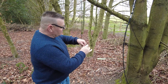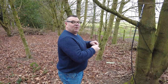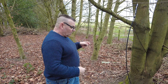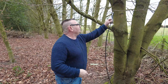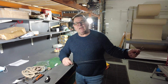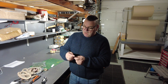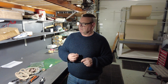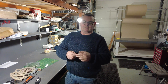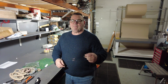After all this, Tom and I are of the opinion that to go backpacking with a full-size dipole — even though it is linear loaded — is slightly crazy; it might be a bit of a big ask. We've overshot: every 10 centimeters — which is about 4 to 5 inches — turns out to be 10 kHz. So we took 1.5 meters off and it shifted about 150 kHz. We're just going to add a little bit back in and see where it tunes out.